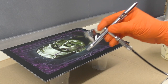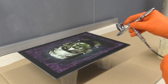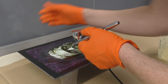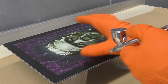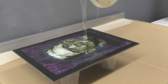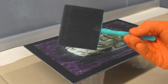To apply the resin, make sure the surface is 100% clean and free of dust — you can tack rag it. I'm using an airbrush to blow off any dust; it's not a huge image so easy enough. Make sure you've got gloves on if you're touching it, and once satisfied the surface is clean, pour the resin starting in the center — it's going to level out, so make sure your bench is level.